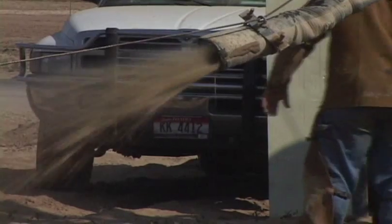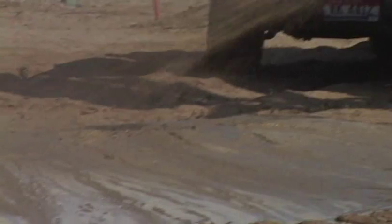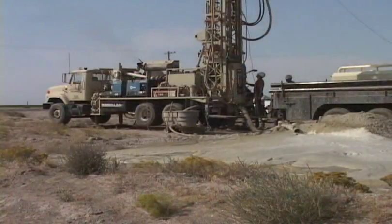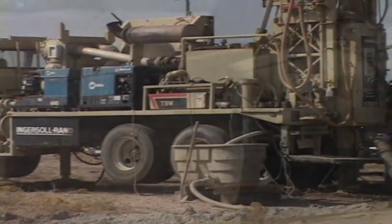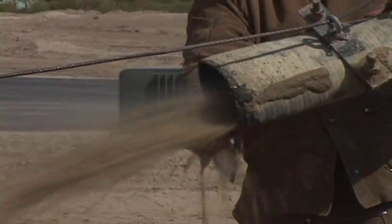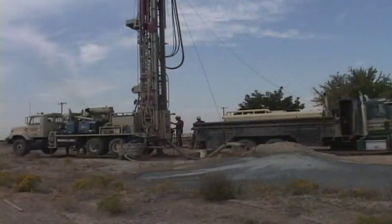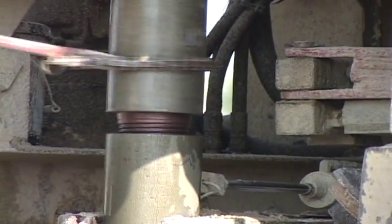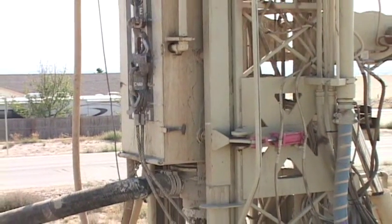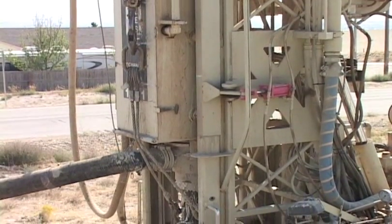In this water well example, the formation samples are returned through the discharge hose. In hazardous waste applications, the samples are returned through the discharge hose and collected in an approved collection and sample barrel. Small aquifers of less than 1 gallon per minute can be easily detected. Hazardous waste site drilling often requires formation samples many times at 2 to 5 foot intervals. Flush-threaded casing is used to save time in casing installation and to avoid safety issues when drilling in landfills where methane gas may be encountered.